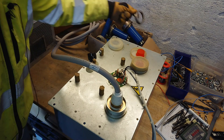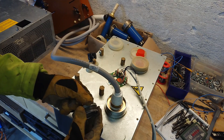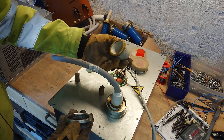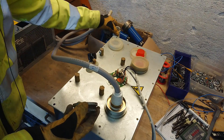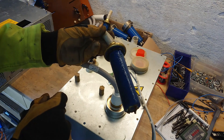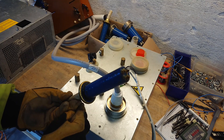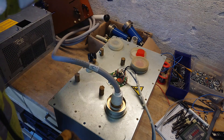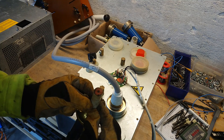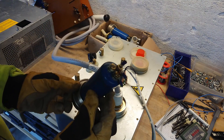I'm making sure to wear gloves because this is some oily and nasty stuff. There are different rings you use to tighten down and keep the plug in place, along with some different protective shrouds. This one says 75 kV peak. Some plugs are constructed differently with a metallic shroud that you can press-fit down against, but it's the same three pins at the bottom. The cable itself is an orange silicone insulation material with a black wire and raw copper in the middle, and it's shielded on the outside.